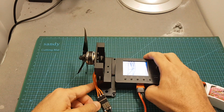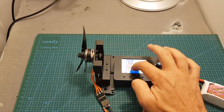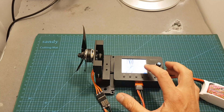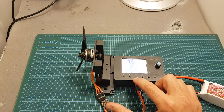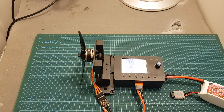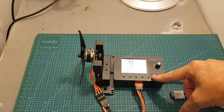After securing the thrust stand — this is just temporary; it's recommended to use screws — I can start the auto testing. Press start and choose the program. Long pressing M1 starts program one, cycling through 10, 20, 30, 40, 50, 60, 70, 80, 90, and 100% throttle using the set time interval. Long pressing M2 cycles between 25, 50, 75, and 100% throttle. M3 cycles between 50 to 100% in 10% steps. After the test completes, the motor is still live so make sure to long press the stop button to fully stop it.